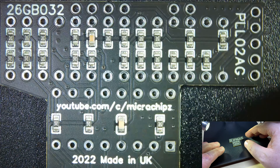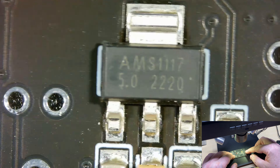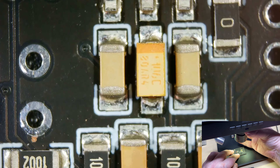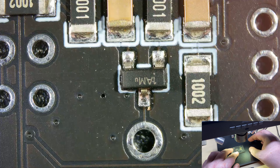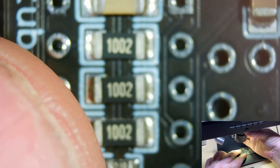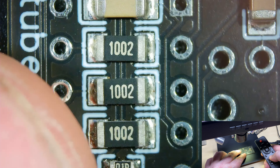The parts we're looking at here are 0603 size — specifically 10k resistors. Moving back to the other board, that's actually a 5-volt regulator. Those red components you just saw were surface mount 4148 diodes, and I think those are 1206 sized 10k resistors.